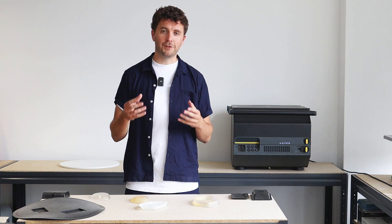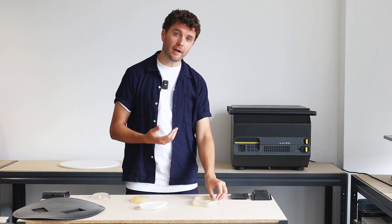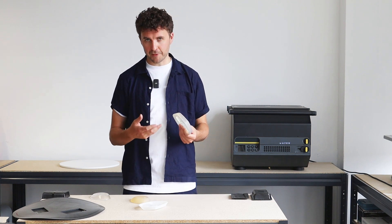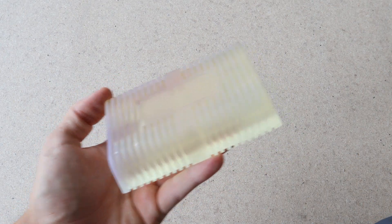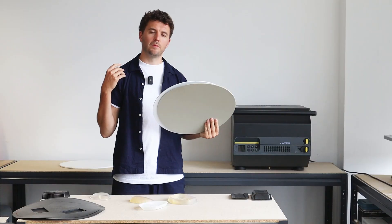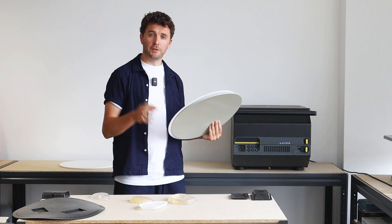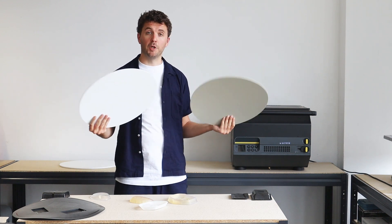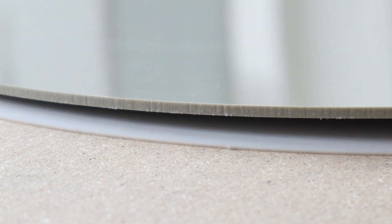So what do the two technologies of vacuum forming and pressure forming have in common? The design guidelines and constraints between the two technologies are actually fairly similar — you can use draft angles, air holes, and either male or female tools. As for materials, between pressure forming and vacuum forming you can use any type of thermoformable material. The key difference is that a pressure former will be able to handle much thicker gauges of material because it is much more powerful.